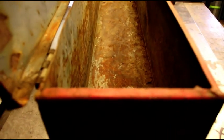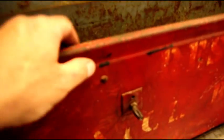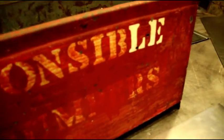If I want to do that bottom, I'm going to have to change over the tooling in the flanger. And you can see on this front, we've got another little joggle there, and then we've got a bend. And it's a big piece. It's got a lot of bends to it. So I think we'll do the bottom next. I'll set up with some 3/4 tooling and run that through the flanger. I'll show you that when that's done, and then we'll move on to the main box part.